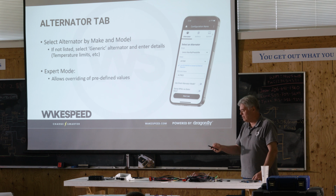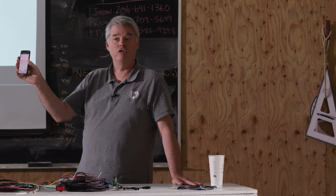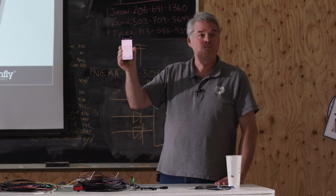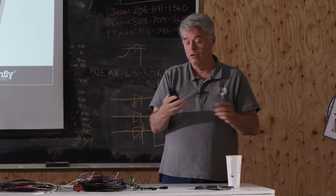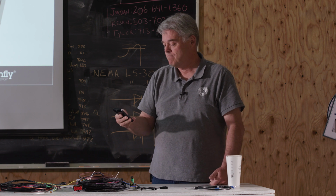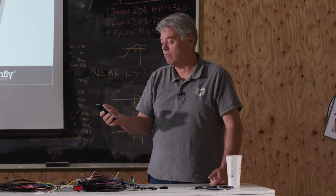Use RPMs to select half power. Who asked the question about what happens if the engine stops running? That was you. This is how you could do that. You would do that with two things. One, hopefully you're getting RPMs in a stable way. You would say, you know what? If this engine is ever under 100 RPMs, it's probably not running.